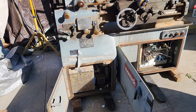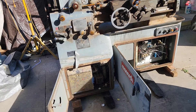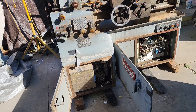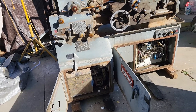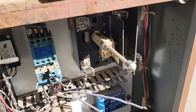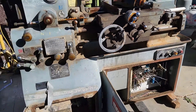That was a little annoying, but it seems like it's as simple as there are about three or four transformers that I have to change from 460 to 230, and then I have to change the pump from 460 to 230. And where these three fuses were down here that are missing, I bought 30 amp fuses instead of 15.